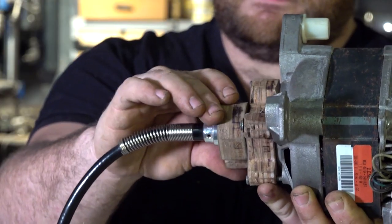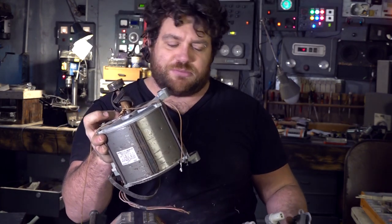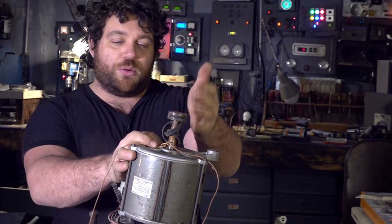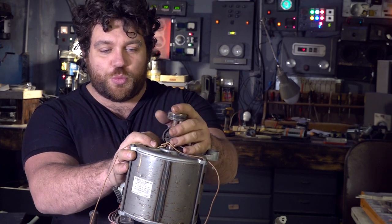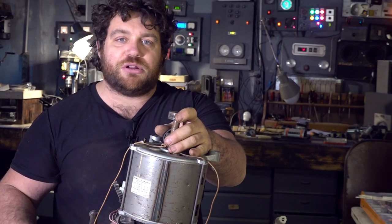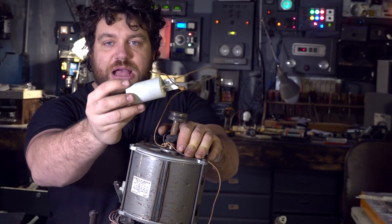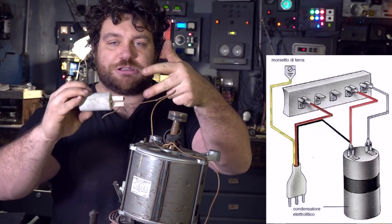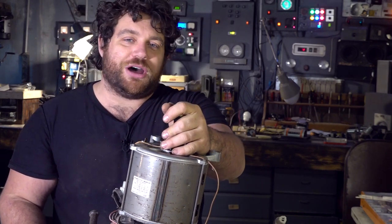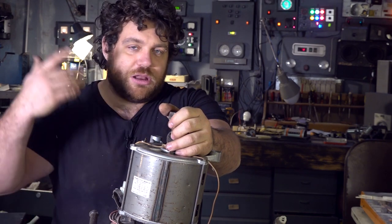You're probably wondering which type of motors you can find inside a washing machine. There are three types, but today I'm talking about the two most common ones. The older, most common motor is an induction motor — the one I love most because it's very easy and cheap to control. You can change the direction and you have two speeds because there are two coils inside. You can control the direction using a capacitor: depending on which side you connect the electricity, the direction changes. One coil gives high RPM, around 1000 RPM, and the other gives low RPM, around 500 RPM.